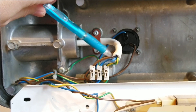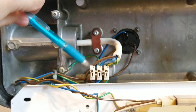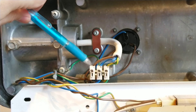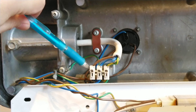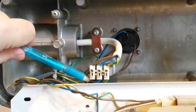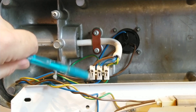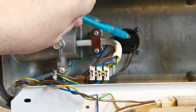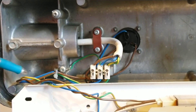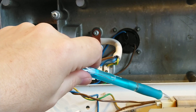We're now inside and the power has been disconnected. The live wire comes into this light fitting and goes into this connector block, which is screw-fitted on one side and push-fit on the other. To remove the wires on the push-fit side you just insert a screwdriver and they can be pulled out. The live goes to the photo cell, and from the photo cell it comes down to the ballast.